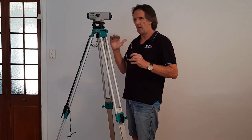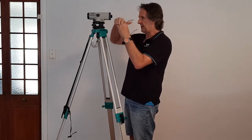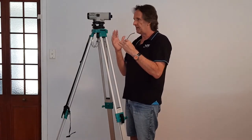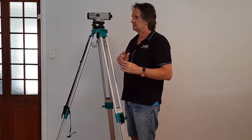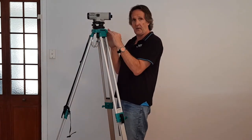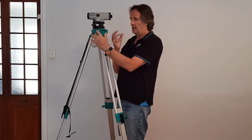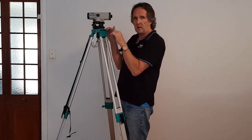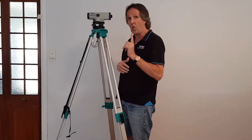It's where a lot of people, when they first start using it, come unstuck. They pull and push on the thumb screws and the whole instrument gets out of alignment with the adjustable base. When they start taking readings, because it's so far out of parallel, it can introduce all sorts of errors. Those few simple steps about pre-adjusting the thumb screws evenly before getting it on the dome head, then using the capture bolt to float it and get the rough adjustment on the bubble into the ring — and you only ever have to use two thumb screws, one at a time.